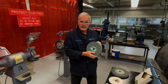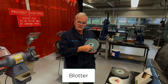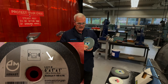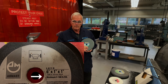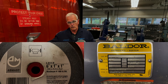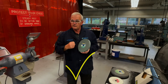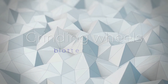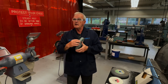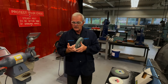While I have grinding wheels out here, I want to talk briefly about the blotter on the face of the stone. The blotter contains a lot of good information — it tells us the diameter of the stone, the width of the stone, and the maximum RPM the stone can be safely operated at. You have to match the stone to the grinder and make sure the grinder's maximum RPM is not greater than the stone's maximum RPM, or centrifugal force could cause the stone to fly apart. The blotter also provides information on the makeup of the stone: aggregate size, void space between aggregates, and the bonding agents used to hold it together.